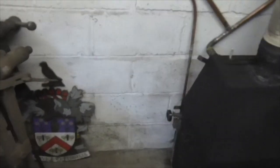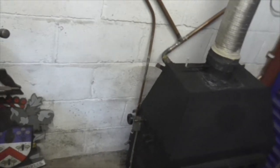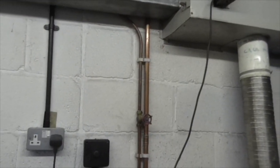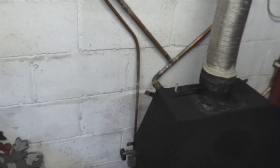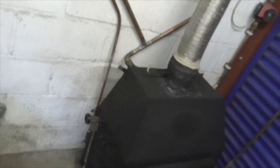And then what I shall do is I'll drain down into a tub, right, and then I'll put the water back into the tank and turn the valve on again, and then turn the mains water on and allow the mains water to top it up if it needs it, because that way I keep all the leak sealer and put the leak sealer back into the system, because the whole idea of the leak sealer is that it stays in the system. So there we go.